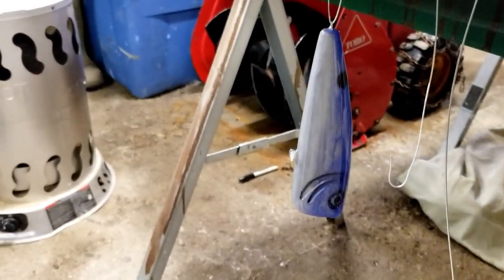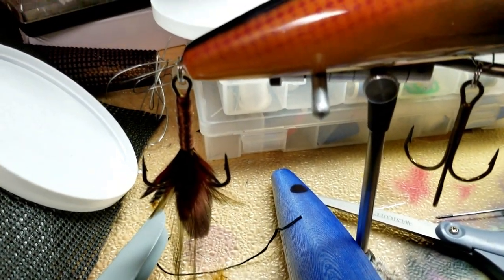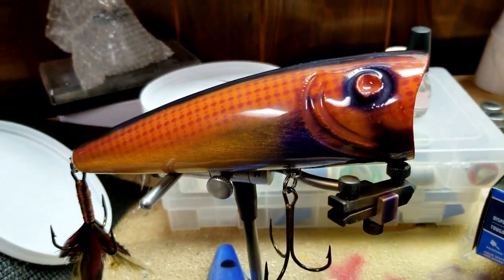Just to reiterate: this isn't a true chemical fume hood. I'm not going to be doing anything really dangerous in here. I'm definitely not using flammable materials in here because the fan and wiring are exposed to those fumes — you want to be sure you can't have a fire in that area. That's also why I didn't go with four-inch vinyl ductwork — I wanted the ducting to withstand something if something did happen. But I am making a lot of hard baits now, and this is a big reason for this — so I can do soft plastics and epoxy hard baits in the basement.